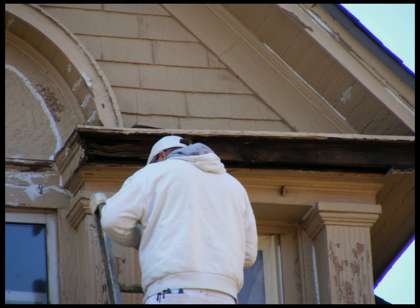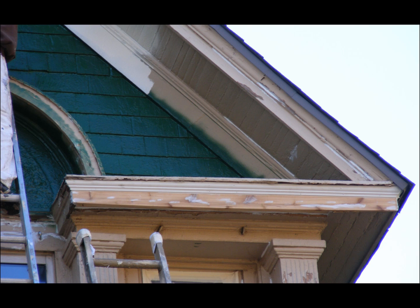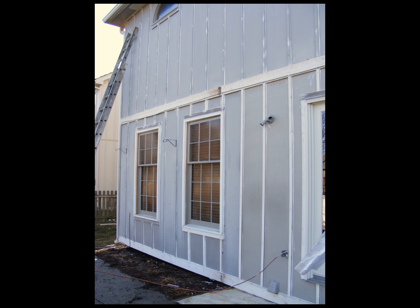As far as some of the repairs that we've done — this here is on a 120-year-old house where we went through, pulled the fascia board off, and pulled all the trim boards off. We actually have to make these ourselves, putting the fascia board on as you can see. In the next picture you'll see us putting up the trim board. You can't just go out and buy old trim or new trim boards that match old siding and old trim — we actually have to make them or mill them ourselves right there on the job site.